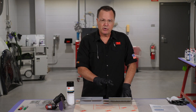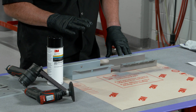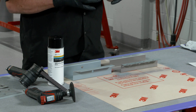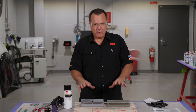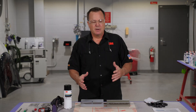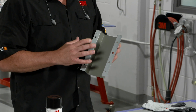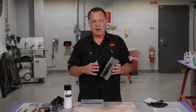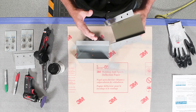I'll now show you how to remove that coating from the weld area so we don't get contaminated welds. Now that I've applied both coats of weld through primer, allowed it to flash, and it's dry to the touch, we can mate these parts together. I want to show you a very simple way to clean the primer from the immediate weld zone. Remember, it's a weld contaminant — we want to clear it out of there and only weld to clean bare metal.